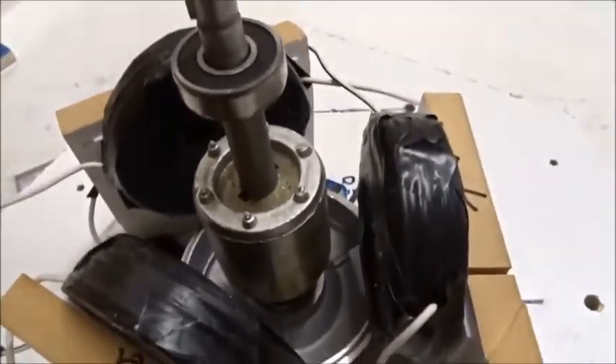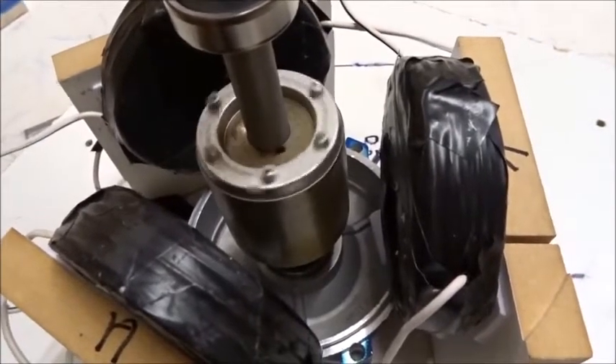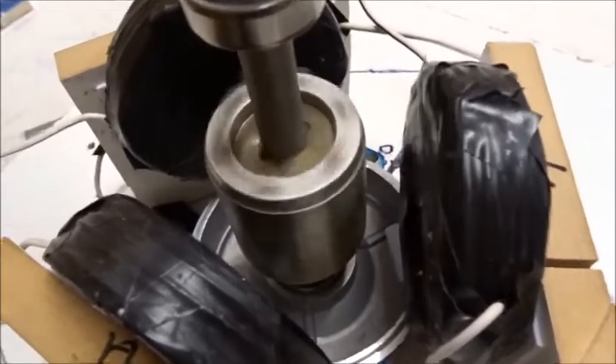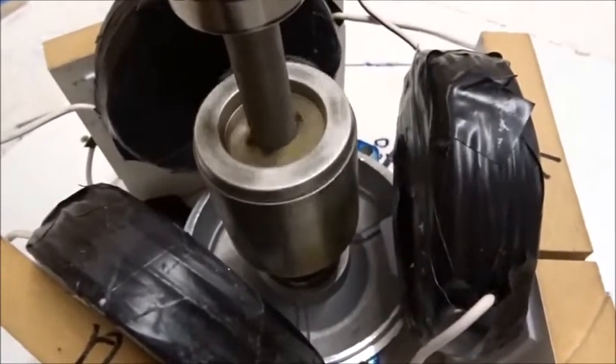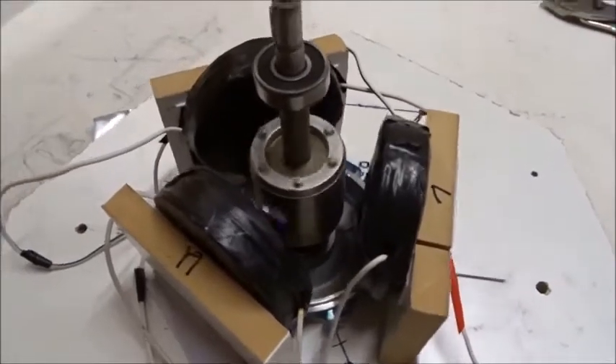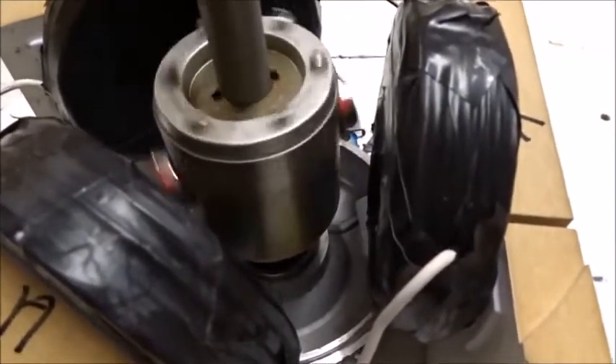Same conditions — we're at just a few hertz if we had a lot of power to these magnets and just have steel alone. This is at 15 hertz. It takes about 10 or 15 hertz to get this thing moving. This has just been a quick demo to show how much power we could get by combining magnets with a copper induction rotor.